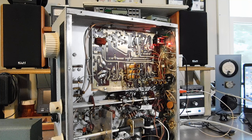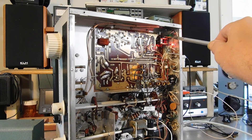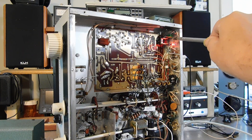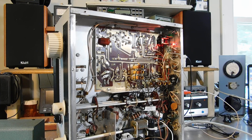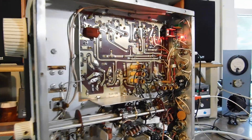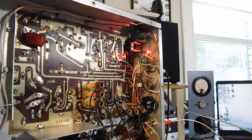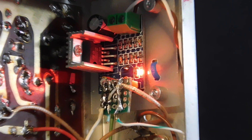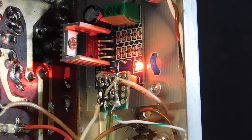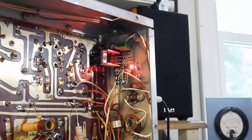Here it is. Since I'm not using the tube anymore, I took the audio output transformer out and mounted my little module on a piece of fiberglass, then mounted it back in the place where the audio output transformer was — back in that rear corner, just like that.